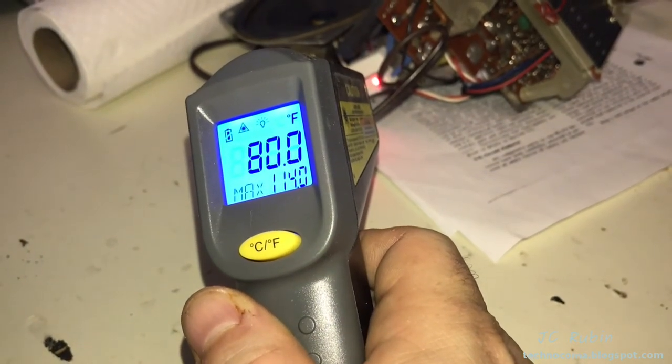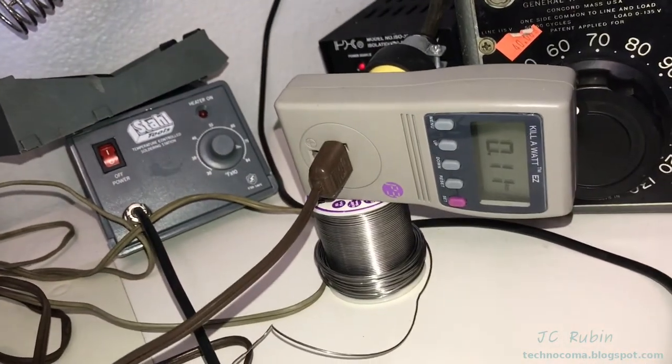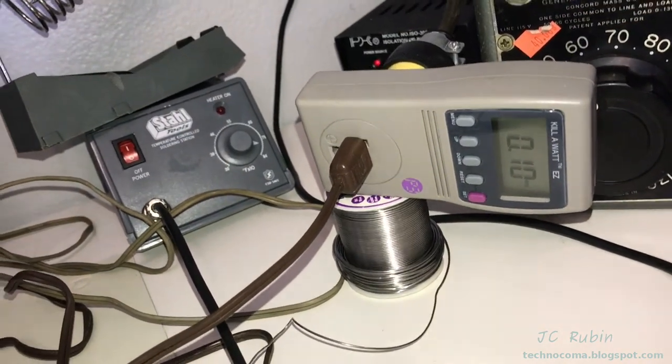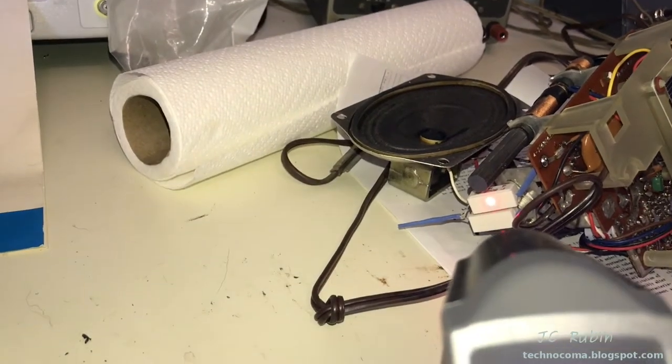Bottom one, still sitting at 80, doing nothing. So we're sitting at half voltage. It's showing 60 volts as measured, and it's a tenth of an amp, so 60 volts, 100 milliamps is what we've got right now. And boy, that voltage dropping resistor is cooking.